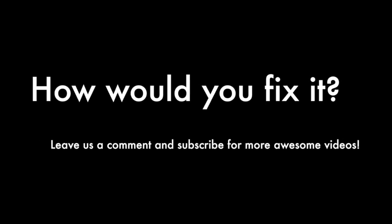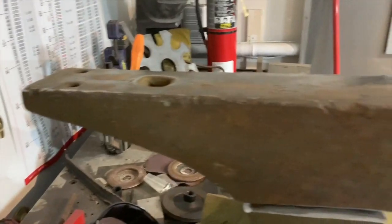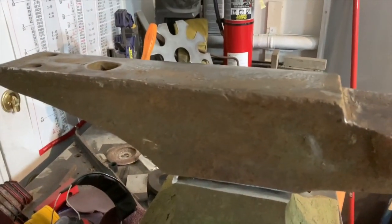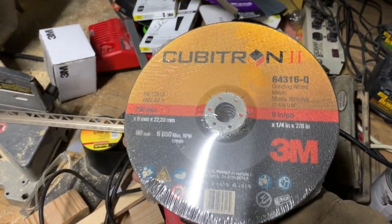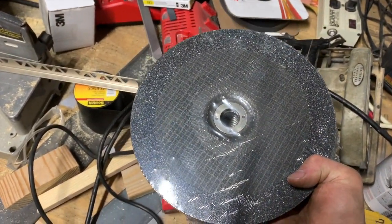Here's something I decided to check — how flat the top surface is, because that's going to be a big consideration of whether or not I mill it. There is about a 30-thousandths of an inch gap, which is making me lean toward grinding it in some form. I don't mean on a surface grinder — that would be ideal and super accurate — but the first time you use it you feel like you've wrecked it. I'm trying to figure out if I can rig up some way of putting it on the Bridgeport and using a grinding disc to put a nice polish back and forth. I've even got some large Cubitron grinding cutoff wheels — way bigger than I need in diameter — but I can make up an arbor for that to fit on the Bridgeport and go from there.